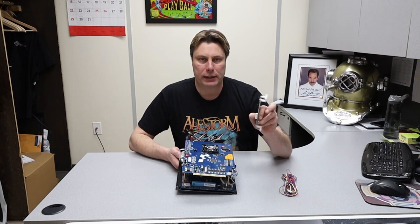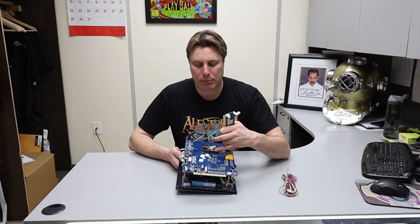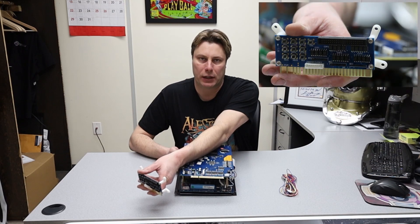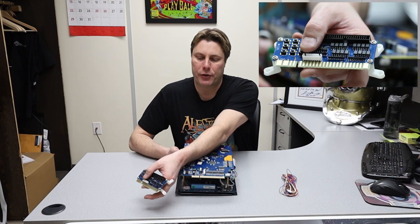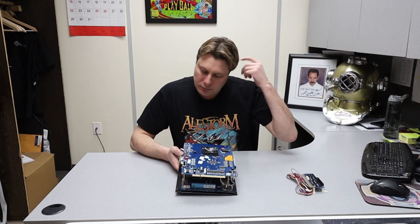This is your satellite board. It should be connected by a long IDE ribbon cable from the top JAMMA board to this board. This board has all your functions — video, main menu, volume — basically everything you need to control the system. The fingerboard on the bottom lets you connect another JAMMA connector for your third and fourth player.